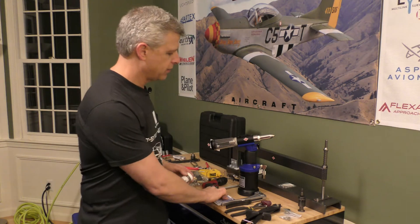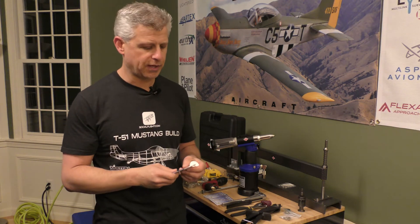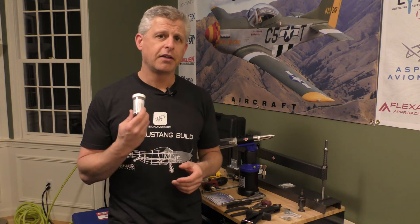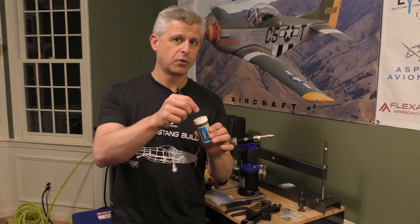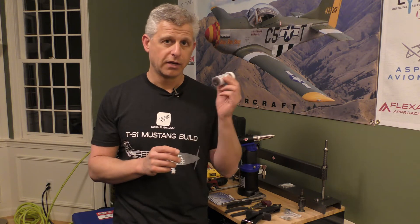For drilling holes we have high-quality drill bits from Aircraft Tool Supply. We've been exceptionally happy with how these work — they're very high-quality cobalt drills that last. High-quality drills are a hard thing to find; a lot of what you find at big-box stores is poor quality. We also got Boelube, a lubricant product from Boeing. Most people don't think about lubricating drills, countersinks, and other cutting tools, but using proper lubricant makes a big difference, especially when doing a lot of holes.